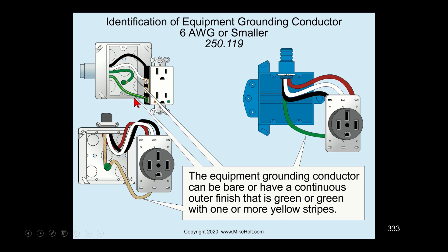We really need to know if this is an equipment grounding conductor, because that's part of the effective ground fault current path that we have to connect to. The code has established that we can use green to identify it as the equipment grounding conductor. It can also be bare, or in some cases green with a yellow stripe. So if you go into a box and see green, that's the equipment grounding conductor; if it's bare, that's the equipment grounding conductor.